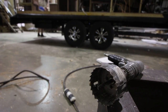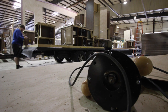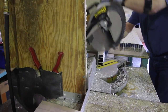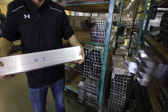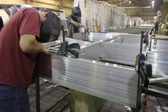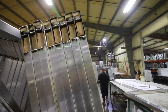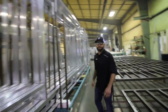Whether you're making a truck camper, fifth wheel, or travel trailer, it all starts with the aluminum superstructure that Northwood is quite famous for. This aluminum superstructure is pre-cut and bundled so it makes it very easy for the welders to start their job. It's 060 grade aluminum, which is thicker than industry standard, and it allows them to do full bead welding. This is the stage where it all gets welded together and ends up looking like a sidewall.